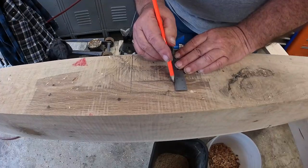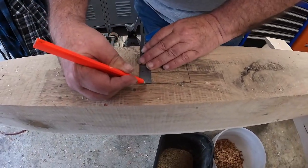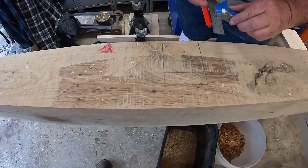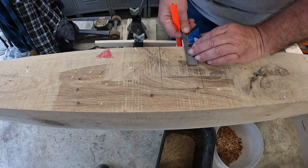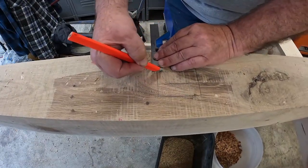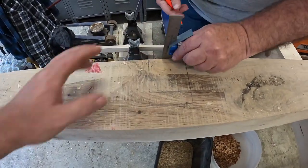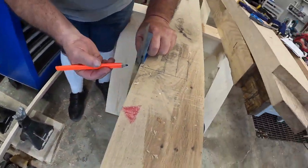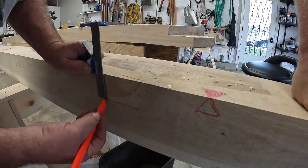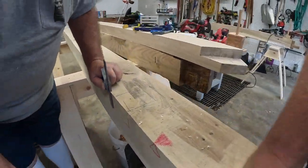Then you draw the back line — that's the back of the V. You set this one at two and an eighth and draw this line, which is the top of the lap. Then two and an eighth down this side, and two and an eighth down this side on each side of the rafter, and then across — and that creates the lap.